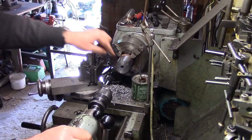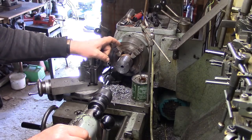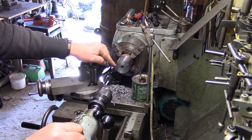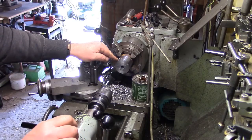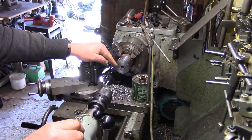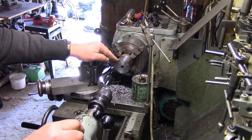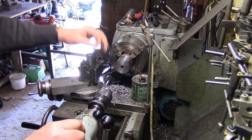So what I'm thinking is I'm going to drill that out to around about the 18mm mark, all the way through. And then when I've got to bore this in, depth wise we've got to go in an inch, and then bore it out diameter wise to, I think it was 1.343. So if I go all the way through, no bigger than 18mm, when I flip it round in the jaws, sorry, in the chuck,